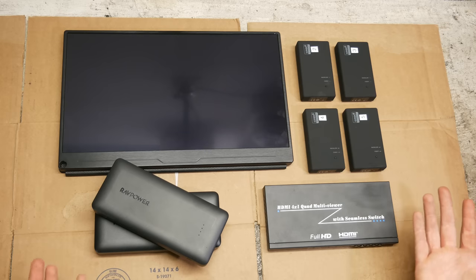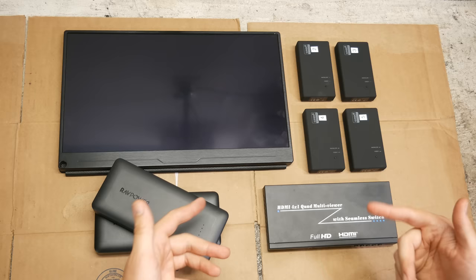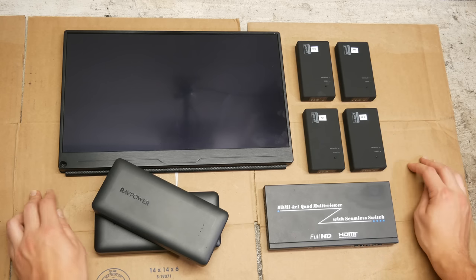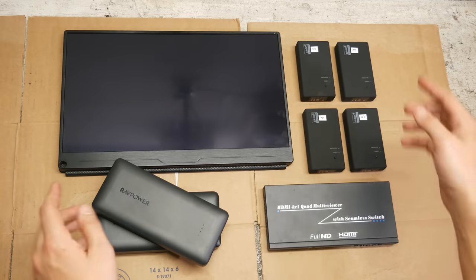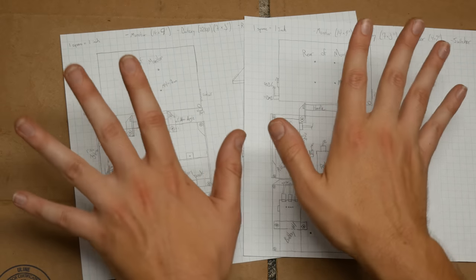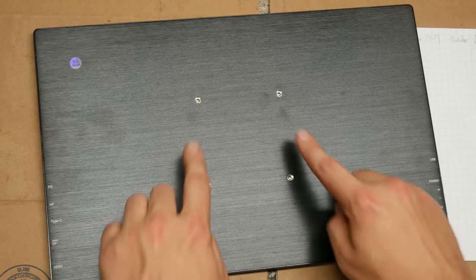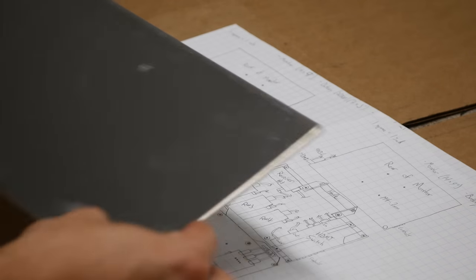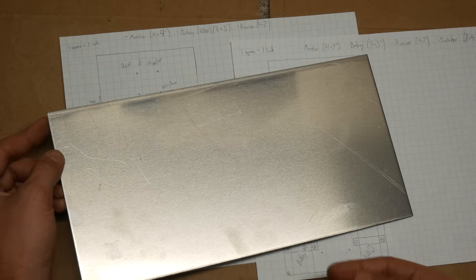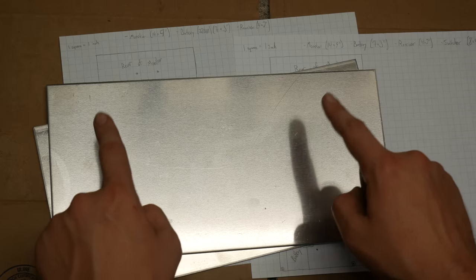So for both setups the concept works, which is amazing given how pieced together this is and how many different pieces of technology are getting along. But it's a mess. You can't just pile all these things together and carry them somewhere — too many parts, too many wires. The first part of the project is done: making this work and finding all the pieces. The second part is building an enclosure to house it all. After spending way too much time thinking about this, I drew up two pretty simple diagrams. The basic idea is to use the VESA mount on the back of the monitor to attach it to a piece of 16th-inch aluminum plate, then lay everything out, secure it, and tie down the wires.